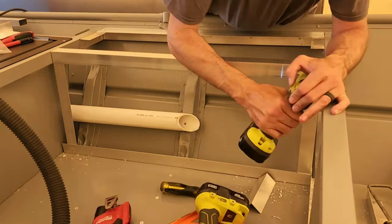I was able to pour foam around the perimeter of the live well, adding some insulation to help our little green friends have some stable water temperatures in the event of a tournament. With the pour foam in around the live well, I then reinstalled the lid permanently, added a bit of framing, and I capped it off by installing the decking surround with countersink rivets. Lastly, I used some pour foam around the back cooler area voids where I could get it in. From there, I was back in the rod lockers for finished details.